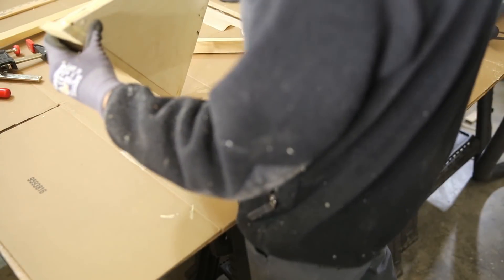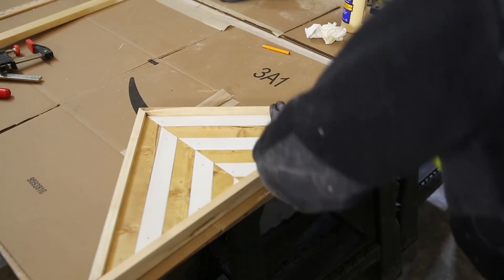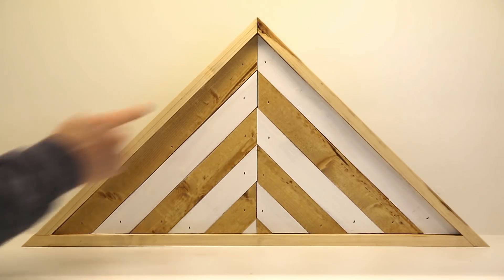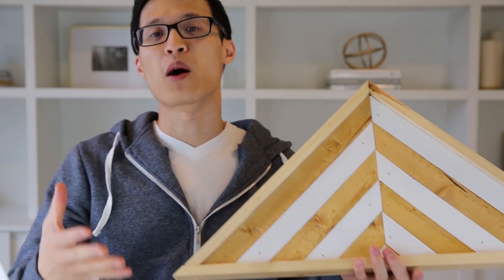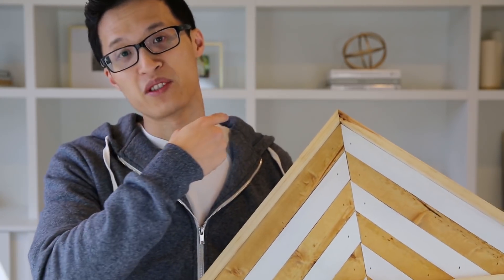Use a brad nailer — I used 5/8 inch brad nails to hold the pieces in place. One-by-twos were used for the framing of this piece; they're a little thicker at 0.75 inches, so I planed them down a bit to give it a thinner profile. I cut a 45 degree angle here, a 45 degree angle here, and another 45 degree angle here on the miter saw. Thanks for watching, appreciate the support — follow me on Instagram, subscribe, and keep an eye out for next week's video on the built-in library.